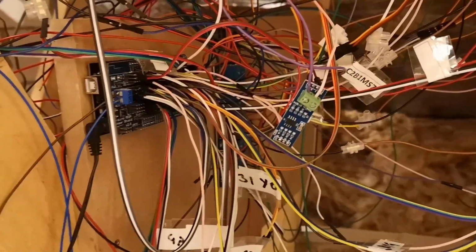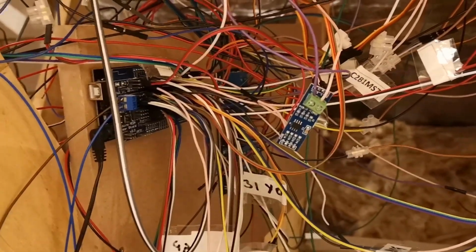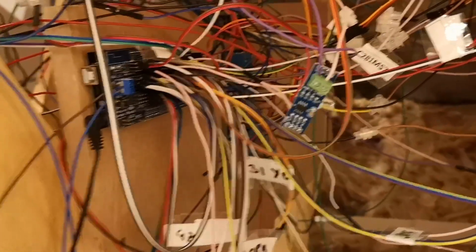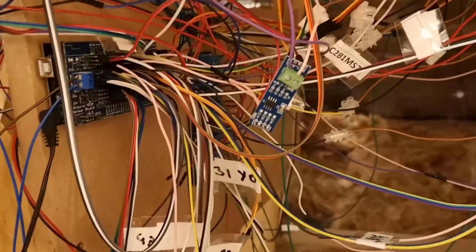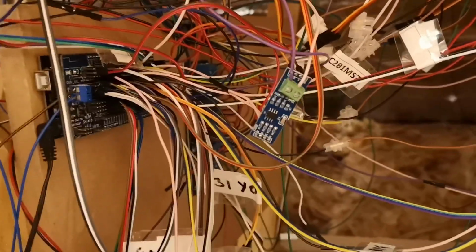TCP/IP based communication methods like Wi-Fi and Ethernet, certainly if someone is just starting out down this path of getting accessories communicating, then if Wi-Fi and Ethernet is the preference, look at MQTT, especially if you're natural with code. However, if someone's using CMRI, my experience of it, having now maybe got 90% of the way towards transitioning to MQTT, is that CMRI requires less code, and the code involved on the Arduino side is less complicated and easier to maintain in the sense of adding the odd turnout and adding the odd sensor.